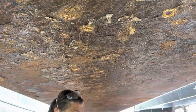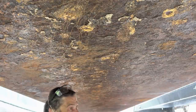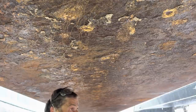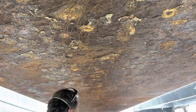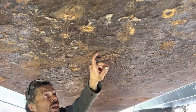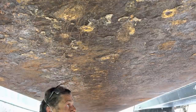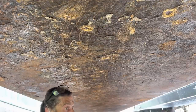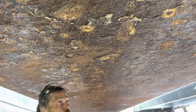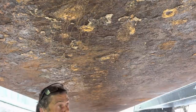But people are commenting about using a needle gun, which would help. It'd totally clear it all. It means a horrible tool to use. Not that I've ever used it, but everyone here says, oh, you don't want that. But moreover, underneath this stuff here, there's a few pits. And essentially what I'm able to do, doing this process, is inch by inch, working in lines, I'm going down, hammering all the rust off, scraping it, and then on some bad areas or areas of worry, I'm going in with a little wire wheel and excavating it all, getting it back to shiny steel, and being able to look at what the pit condition is.